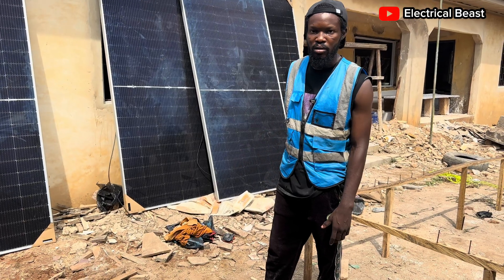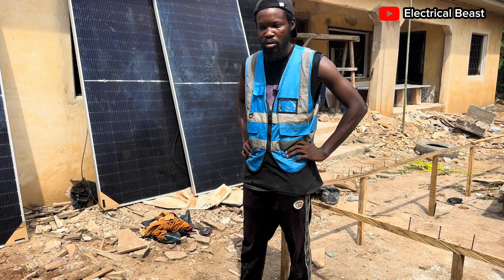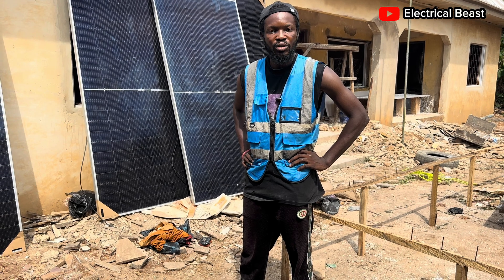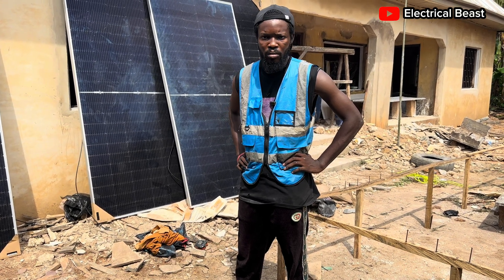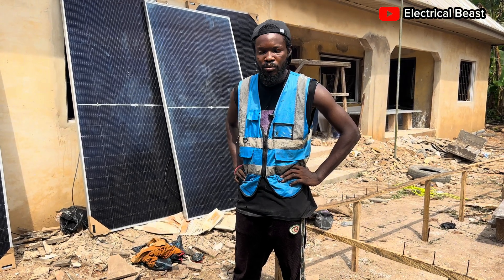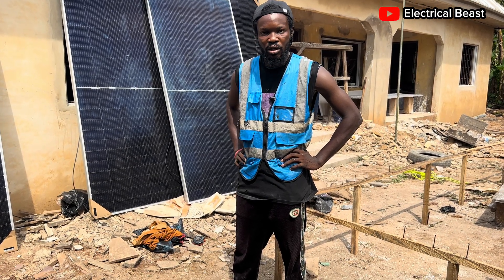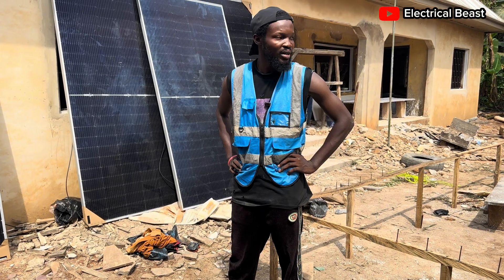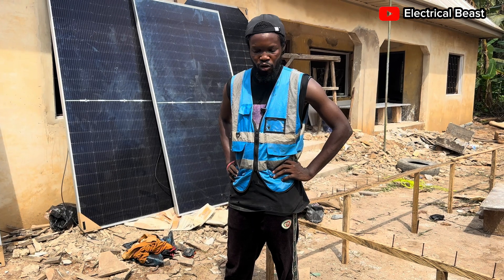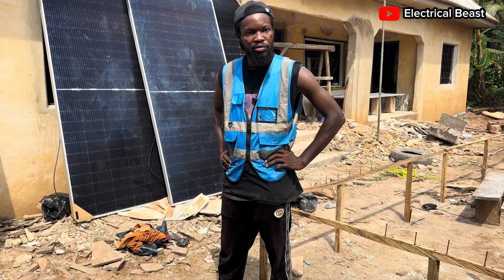That's all for today's test and I hope you've learned a thing or two. This just substantiates the fact that bifacial panels work well — both the front and the back give good readings, and when you use them in the right conditions you get more power for your system. Don't opt for bifacial when you're going to use them on the roof — opt for monofacial, as they produce better and are lighter and more suitable for rooftops. But in case you don't have monofacial, you can go for bifacial. Thank you, keep subscribing to the channel, like the video, and share it. See you in the next video.